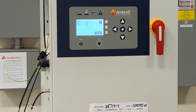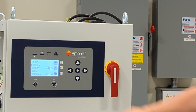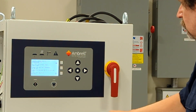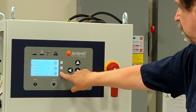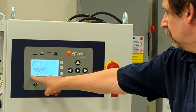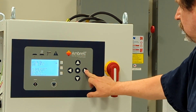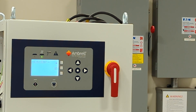Now we are going to perform this operation. First, press the SysStat soft key. Scroll down to the learn start frequency line and press the right arrow key. The display will prompt you to press start. After pressing start, the machine will do a scan and if possible will display a solution that includes transformer tap selection, choke tap selection, and will set the proper start frequency. If there is a problem with the installation or the coil cap combination is not in range, the machine will display an error.